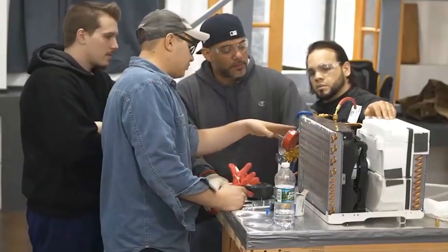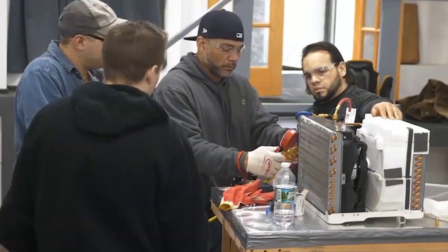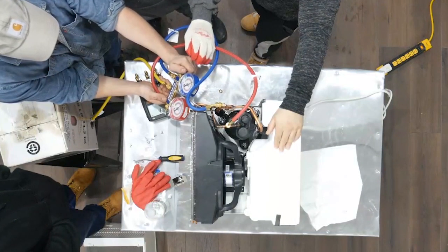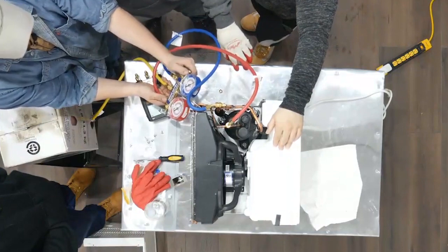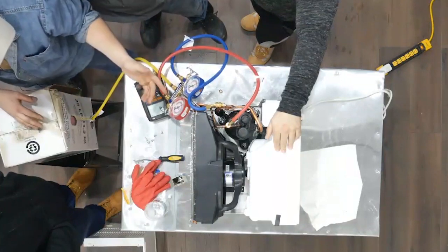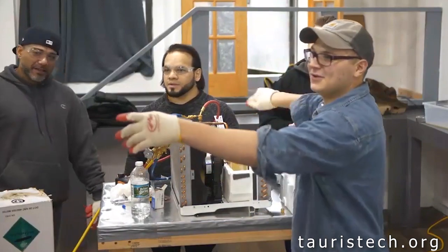She's done. Right now we're actually running with a little low back pressure — we want it at 40 degrees, because when you have low back pressure it can freeze and ice up. We don't want to add air, so we've got to purge the yellow hose, and I'm going to charge very slowly — liquid into the suction side. It's at 35-ish now; I'm going to bring that right to 40. There are a lot of variables when it comes to charging — it's an art form honestly. The ambient temperature totally affects everything. If the space temperature is 95 degrees and you're trying to charge refrigerant, you have to take that into consideration because it brings your back pressure temperature up. Alright, guess what guys — everybody has to pass the challenge!